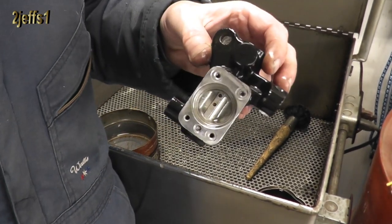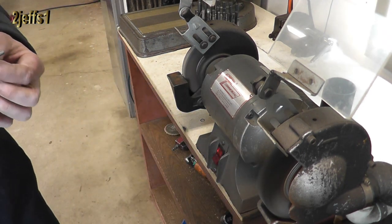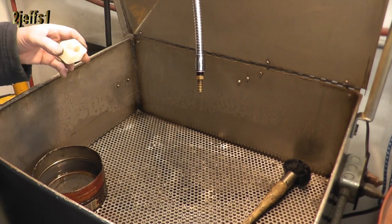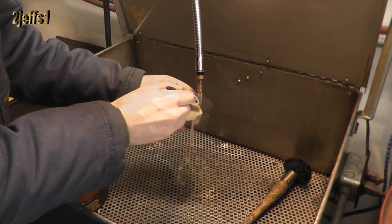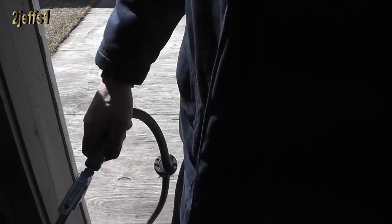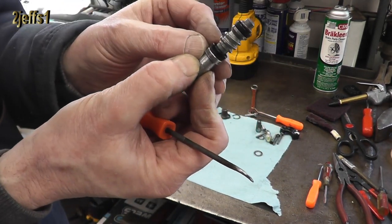Next up, let's continue. I actually got a video on this parts washer — I'm really interested in seeing that. It's popping right out of there. We've got to get the piston seals off. The hollowed part always faces inward inside of your unit, so when it builds pressure, it actually makes those little cups tighter on the bore.